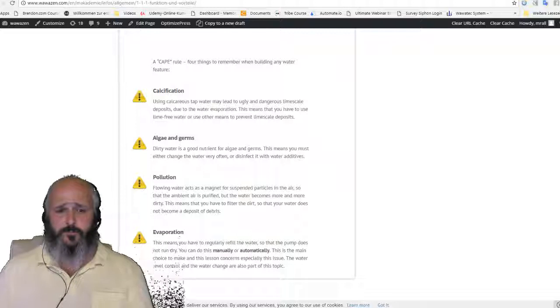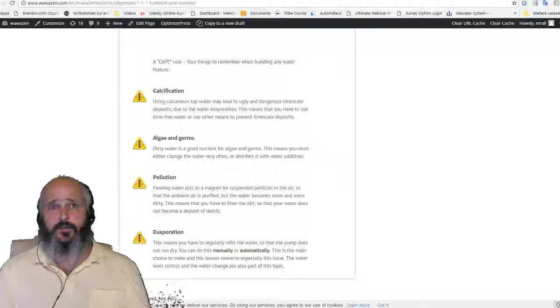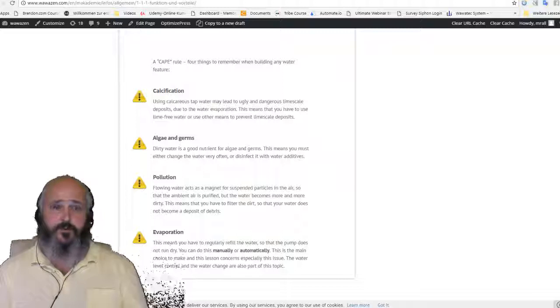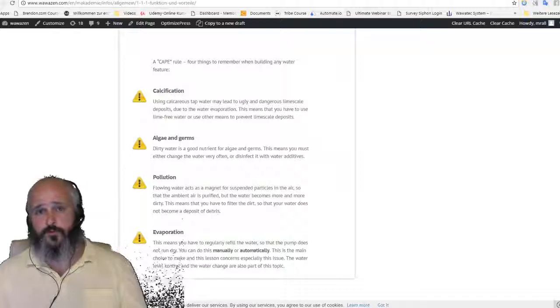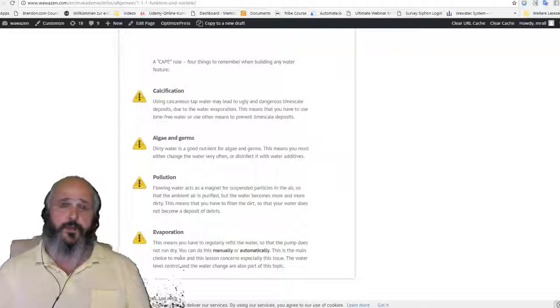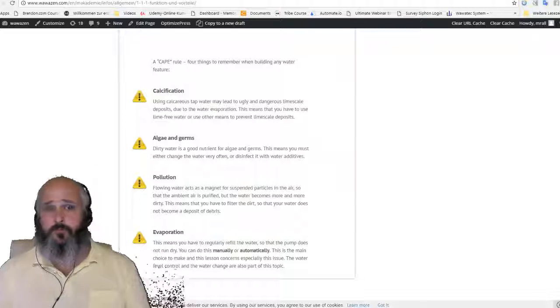And the last point you should consider is evaporation. What we say is, if you have a water wall with a surface of 1 square meter, you can expect an evaporation of approximately 3 to 5 liters per day if you're running the water feature 24 hours. So if you have a water feature which is 2 meters high and 1 meter wide, which is 2 square meters, and you run it 24 hours a day, then it will probably evaporate up to 10 liters into the air. This is good because many people suffer from dry air, so this would be a benefit,